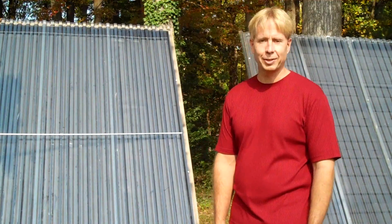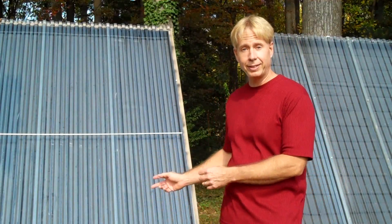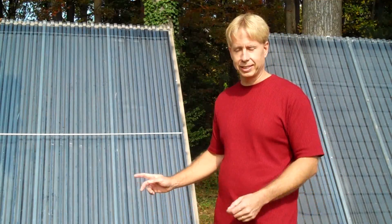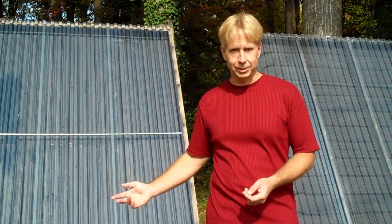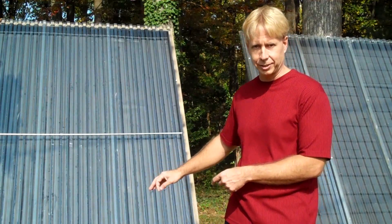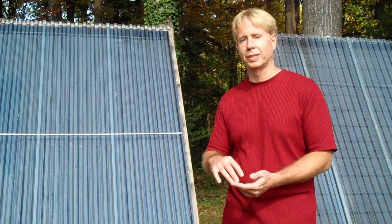My name is Scott Davis, I live in Bel Air, Maryland. I want to take a few minutes to tell you about the latest collector that my son Brad and I built just two weeks ago. This is a CPVC collector we put in our 8-foot by 8-foot test frame, immediately adjacent to our PEX collector, which we built a couple years ago in a 24-foot by 8-foot frame. I can compare the temperature rise of both collectors by sending fluid to the CPVC collector first, then to the PEX collector, measuring a side-by-side real-time comparison with the exact same amount of fluid.